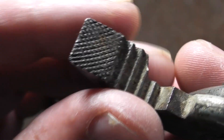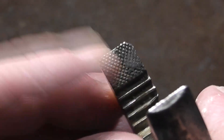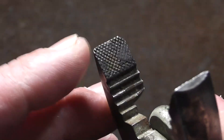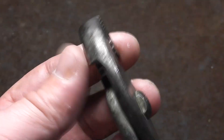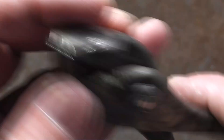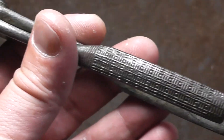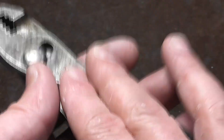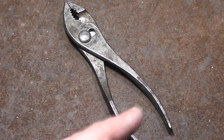One thing I want to mention is I do like the cross-hatching they have on the jaws here. That is something a lot of these pliers do not have — not even the diamonds — but I do like these vintage Crescents because that cross-hatch actually gives you just a bit of extra grip. Really nice, pretty nice grinding on these, and a nice textured pattern on the handle. That texturing is done as they forge these — they have to hit them again to get the texturing, so it's a little bit more expensive.